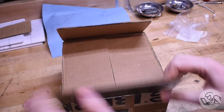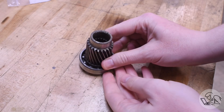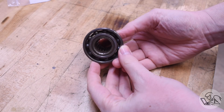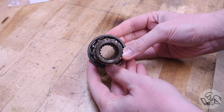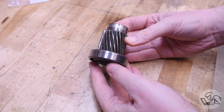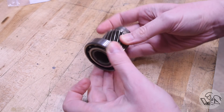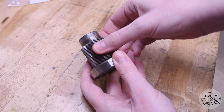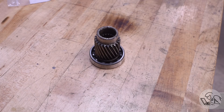My friend sent me this box of bits, and some of these bits need to be connected to other bits. We've got a sleeve with a bearing and a gear on it, a sprocket, and a pillow block. This sleeve is actually the input shaft from the transmission harvested from the original golf cart. It's got a nasty old bearing we don't want, and we don't need that gear hobbed into the outer surface. What's important is that it has that internal spline. The electric golf cart motor has a spline shaft, but the motor is too hard to ship, and matching a spline shaft without being able to test fit it is tricky. So I didn't want to risk making that spline and having it not fit. He sent me this input shaft, and I'm going to modify it into a sleeve that will hold the sprocket and fit onto the motor shaft — and we know it'll fit when it gets there.